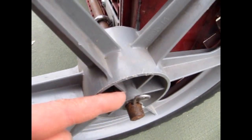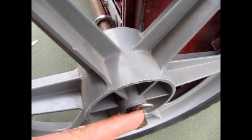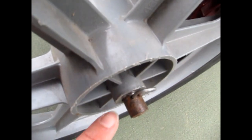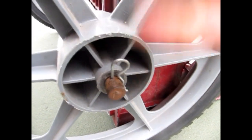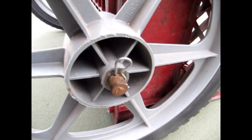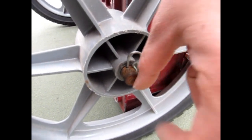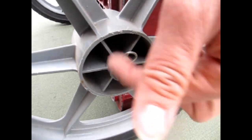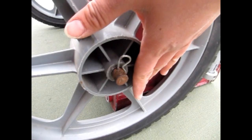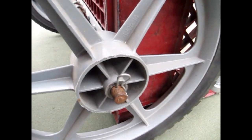The old way I kept the wheel on was by drilling a hole through the axle and sticking in a hairpin — this can pop off quite easily, so you can disassemble the whole thing. Another way I've done it is by welding an eyelet onto here with some threaded screws. You can put a washer and use a wing nut to hold the wheel on. So that's the axle.